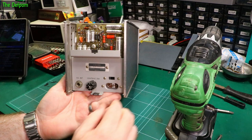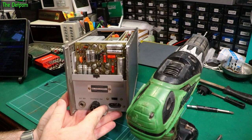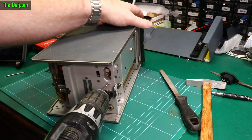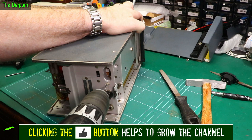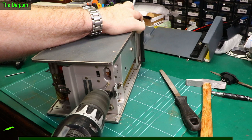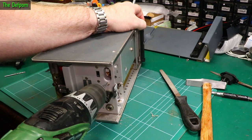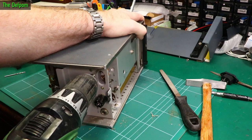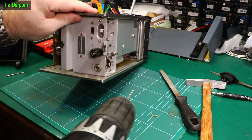Now let's look at drilling this out. I've got a 2.5mm bit or so — I've just got to try and drill these two rivets out here. I did have a center punch to hand. I've flattened off the top of the rivets because rivets are curved, so I used a file to flatten the top so the drill doesn't walk away. I'm intentionally going very slowly, trying to be careful because if I shoot through into the inside it could damage something. I'm just trying to get a nice lead-in so I've got something to guide a bigger drill bit. All we've got to do is just get the top of it and it will just fall off. That's probably enough — let's change to a bigger bit.